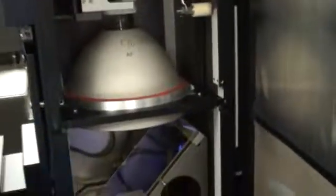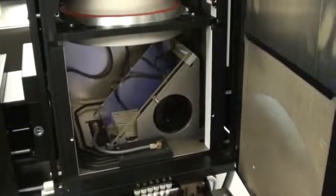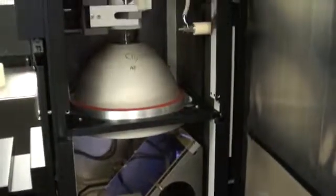Inside the lamp house itself we have a brand new ellipsoidal mirror. In our class-one refurbishment process, that entails replacing the ellipsoidal mirror with a brand new one. There's also a brand new thousand-watt lamp installed. Another important thing: the cold light mirror. The actual shutter assembly was sent out to our partner and completely disassembled and remanufactured. You can see inside the shutters themselves are somewhat saturated from ultraviolet light over the years, but that's just the metal. Shutter assembly rebuilt.